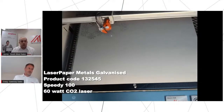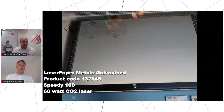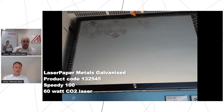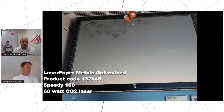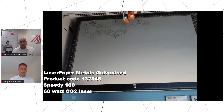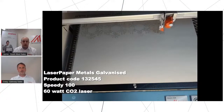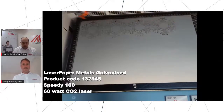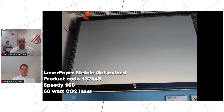There are slight differences in these machines — we're using a servo motor in the Speedy 100, the air assist is built into the machine which we can control via our software, slightly smaller bed sizes, and different lens options as well. Just like Craig said though, with paper and card a really good tip is to make sure we have a separate bed for your paper processing and for your wood processing. It's very easy for wood processing machines to get very dirty with a lot of wood residue on the bed which comes back onto our products with heat.